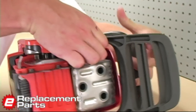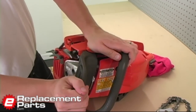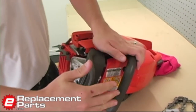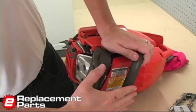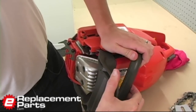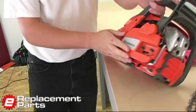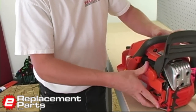So I'm going to lay the saw on its side, line those little dog ears inside that brake mechanism up, and then press down on it very, very hard to press or engage those two dogs together. And with it pressed together, now I can try to unlock it with the brake unlock. Just like that — that unlocked it. And as you can see, the side cover now fits on easily just as it should.